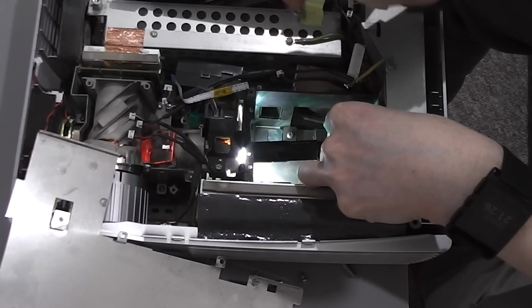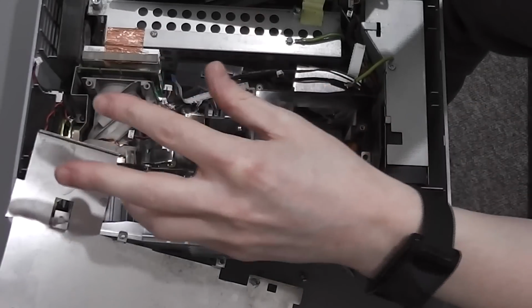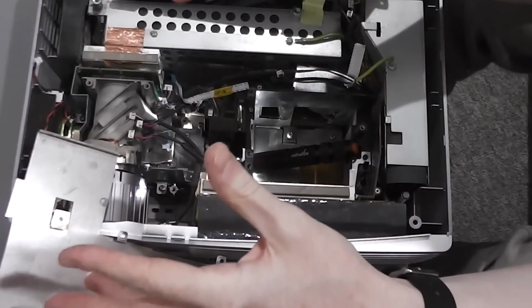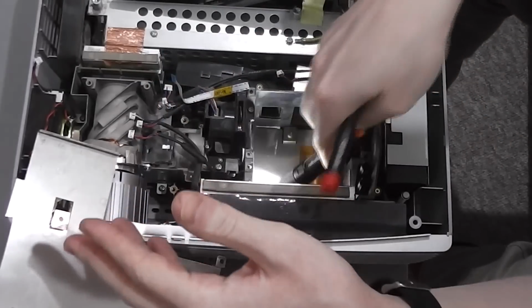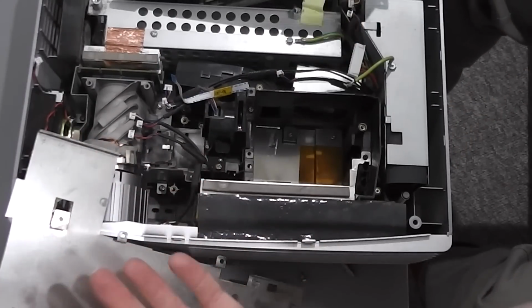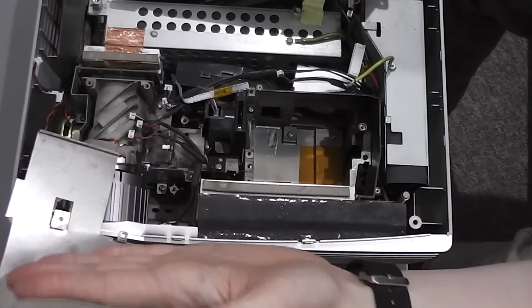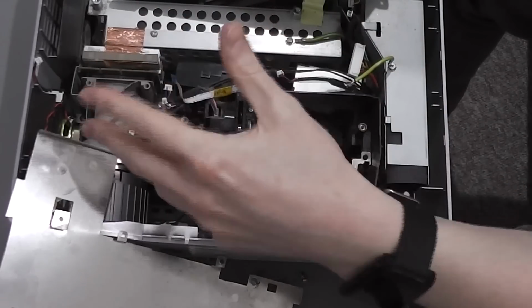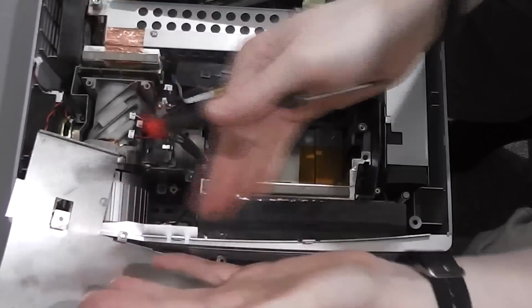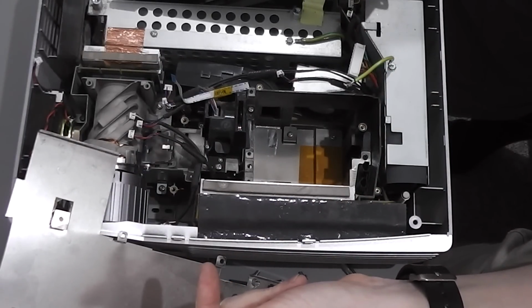And so this spins really fast, and all of a sudden you've got these 4 colours or 3 colours to work with. So if you're working with the red light, and you're displaying the red image, you can set the chip to project the red image. Then when the blue light comes along, it changes and you can display that. And this is obviously happening at a much faster frequency than the typical display frequency you'd find, and so you end up with a single full colour image, but produced from three made like this. So you've only got one optical arrangement here, but it's doing each colour in sequence, and then the eye mixes them together. It's a really clever way to save space like that.